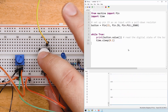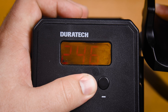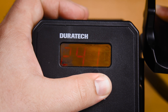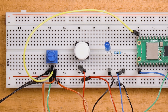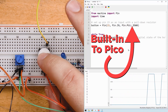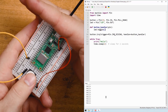Let's start with getting information from a human to a project. The simplest one is a button. Buttons are cheap, easy to use, and often small. They can be set on and off and are great for turning something on or off, but they're also great at changing a value like a temperature on a soldering iron. Ensure you program it so that if you hold the button it rapidly moves through values. When using a button you'll need pull-up or pull-down resistors — most microcontrollers have inbuilt ones nowadays. You'll also want to implement some debounce, and it's always a good idea to use buttons with interrupts, which makes them incredibly responsive.